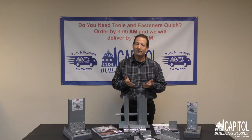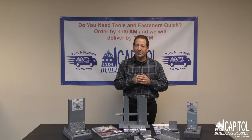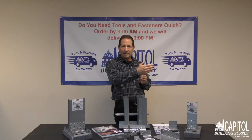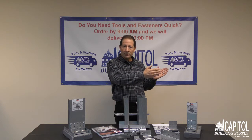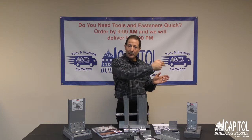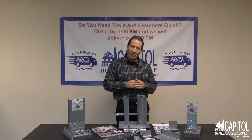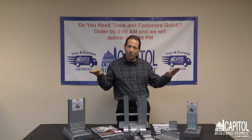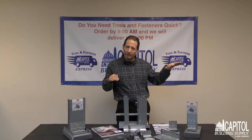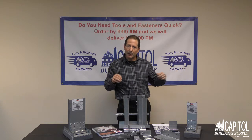There's a couple methods that have been prescriptively done in our industry. One is to take flat strap and blocking. So we'll put a piece of flat strap sometimes on one side of the wall. Due to the wind loads, the design professional may require it on both sides of the wall. A screw has to go at each and every stud, every 4 to 6 feet going up that wall, and then every 10 feet within that strap, you will have to include a 16-inch piece of blocking, which is another stud or track. That will have to go in there.